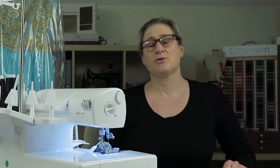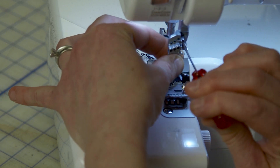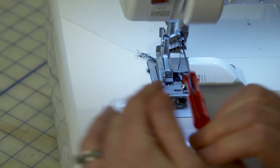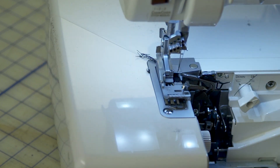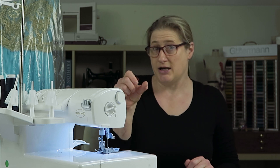To go to B — B is going to make the tension a little bit snugger, because instead of using the O1 needle position, we'd be putting the needle in the O2 position. You can see now the needle is closer to the blade; there's less space. If the needle is closer to the edge, you want to make sure you keep those loopers nice and snug to accommodate a narrower stitch.